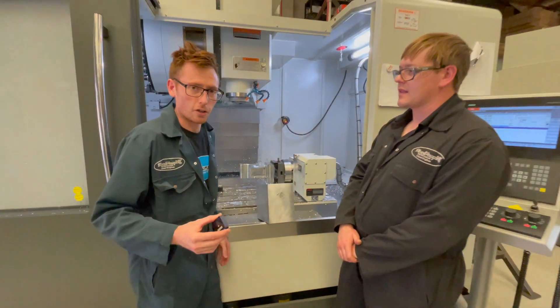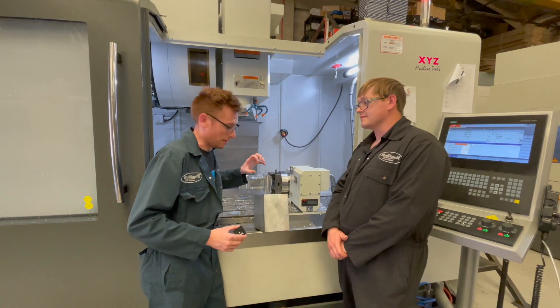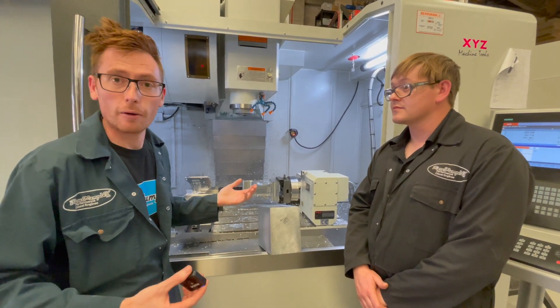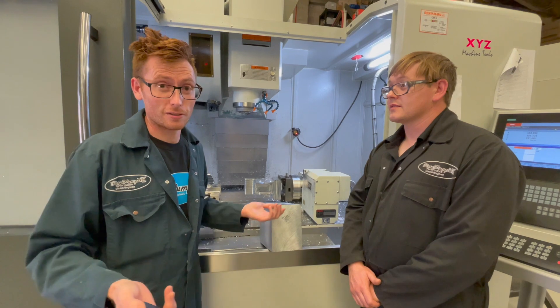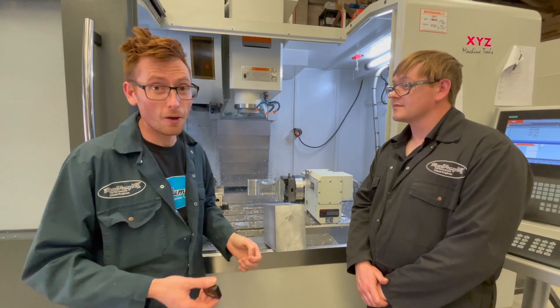So like Jonathan said, the jaws and double spikes like teeth are biting into the aluminium. It stops the aluminium being able to get ripped out because this machine has a monstrous amount of power to tear that aluminium up. What sort of power are we talking? 33 horsepower — which, as you can imagine, through a steel cutter and a steel bolt, it's a lot more than a cordless.